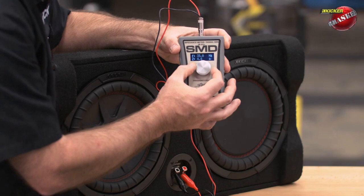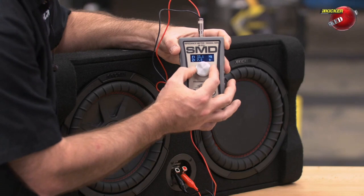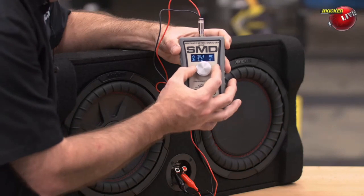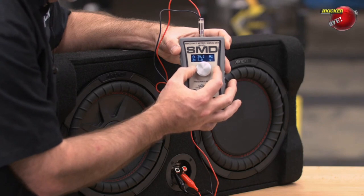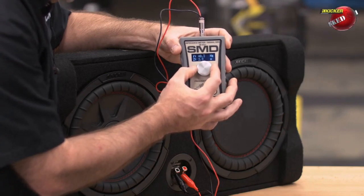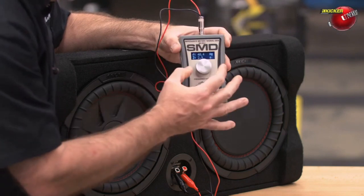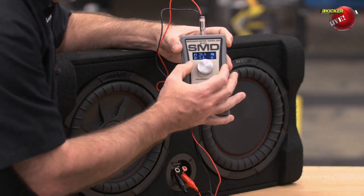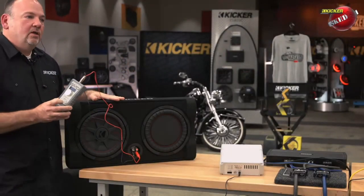So 2.9 — it's starting, as you can see, it's climbing back up. So now we're down to 30 hertz, it's climbed back up to 12 ohms. So I'm going to come back the other direction. 3.3, so 3.3 looks to be about the low. There's 3.2, so right about 38 hertz — that is the tuning frequency. And there's going to be a range in there. You can see it's right in that 38 to 40 hertz range: 3.2, 3, 2.9, then it climbs back up. So we're at that 38 to 40 hertz range — that's the tuning on the dual 10 enclosure.